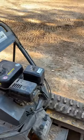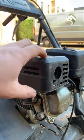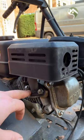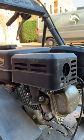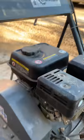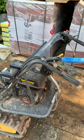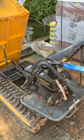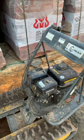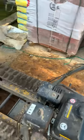The only other issue we had was that I think the engine was dialled up too much and we lost the exhaust muffler — the weld broke just here. I did ring Lumag for a price on the part but it was quite high. It is effectively the Honda 200cc engine, but it's actually the Chinese knockoff — the Lonsin or Loncin engine. To be honest, that hasn't missed a beat; it starts in whatever weather, even below freezing, first time, as long as you use the choke. I ended up replacing the muffler off eBay for a £20 jobby which works absolutely fine.